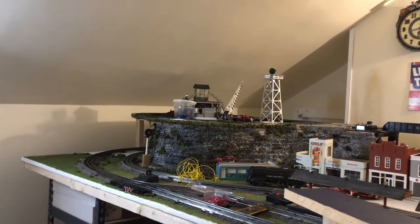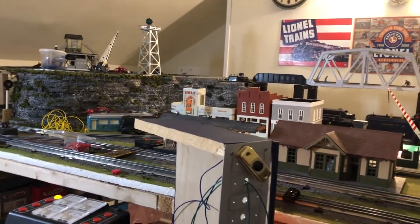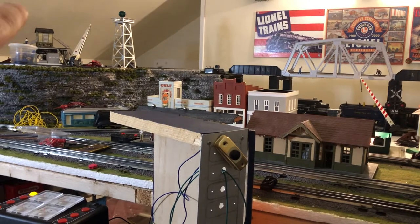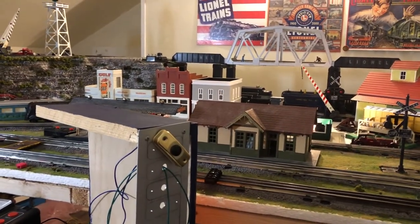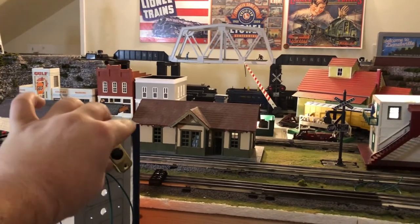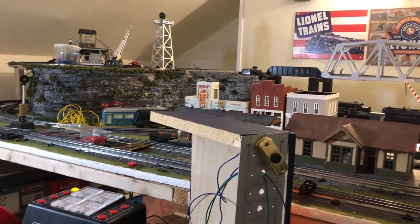It's going to be the ice station all the way at the top, the Lionel icing station. So how that's going to work, you basically just run one wire off of our terminal block. It's going to be run from the terminal block there up to the accessory, run another one back to one of my push button switches, and then after that, run it back to the terminal block to complete the circuit. And I'm gonna have that on one of these doorbell buttons as well.